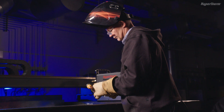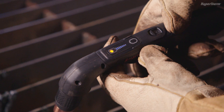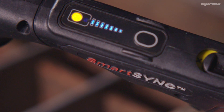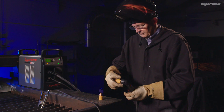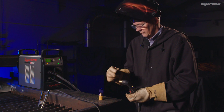Inspect the cartridge. Start by putting the torch in the lock position. You should see the LED status light change from green to yellow. Notice the yellow fault light LED on the power supply illuminates. Locking the torch will prevent it from accidentally firing. Next, remove the cartridge from the torch.